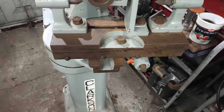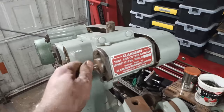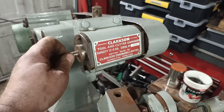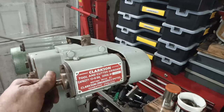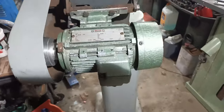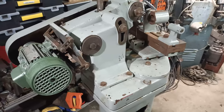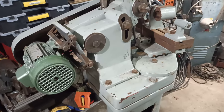So there are a few things I need to do: make the handle, give it a thorough clean, probably a new paint job. The bearings in the spindle feel quite good; I believe it takes oil in there, so I think that should be an oiler rather than a nut — but I'll check the bearings properly. The pulleys are present on both the spindle end and the motor end, but there is no belt. The motor is a three-phase half-horsepower, so I'll need to work on the electrics to get that running. Was it worth getting? Personally I think so — it'll make for an interesting restoration project.